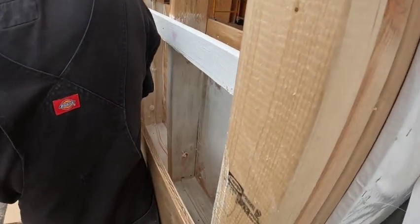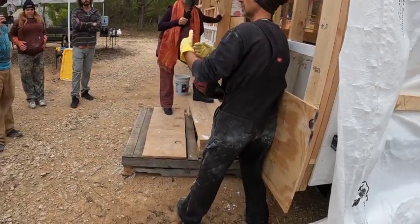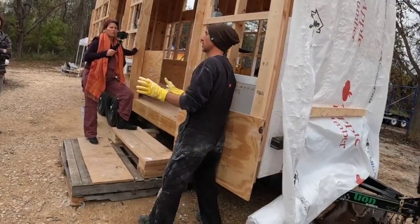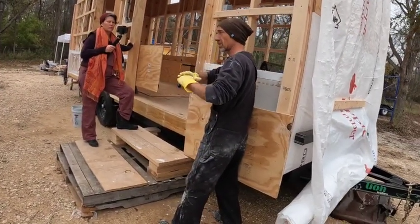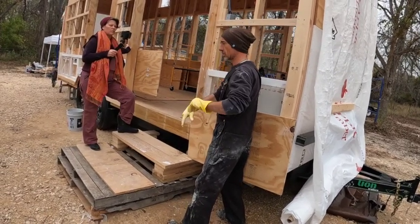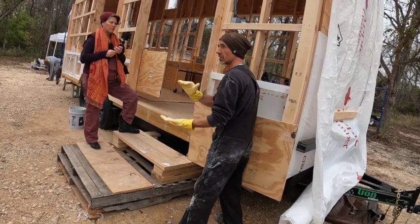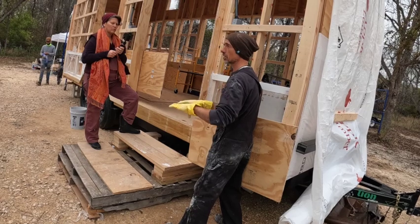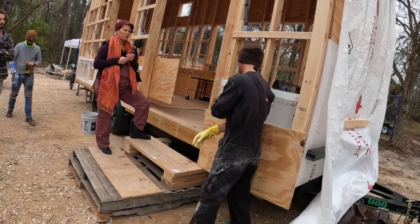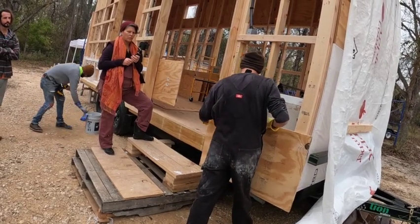I would definitely not want to be doing it an inch or two at a time, because every time you move that foam, it lifts the top of your hemp-crete. As you're moving it, that top bit that's not really got any weight on it wants to lift, and then you have to deal with pushing that back down. So you probably want around a foot of being able to get the material in there, compress that in, and then remove the foam and move it into the next position. So let's go with that metric and put it in for the foot.